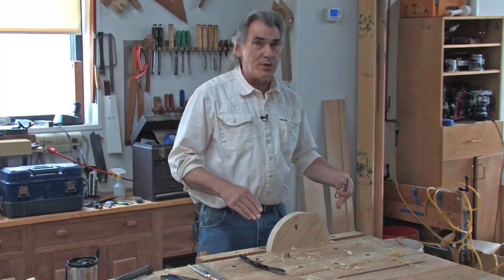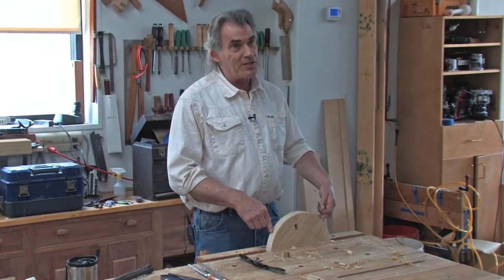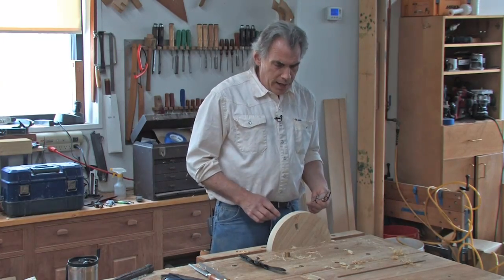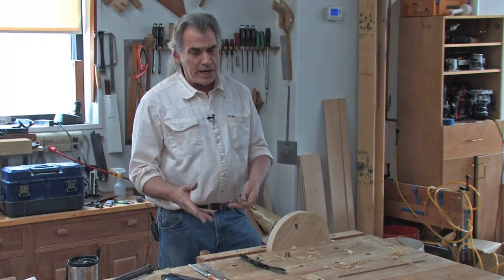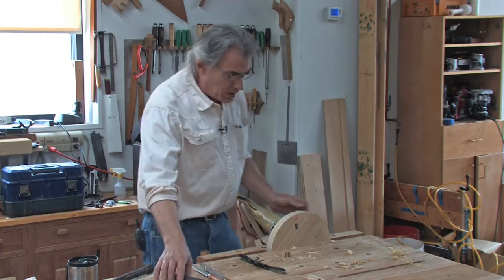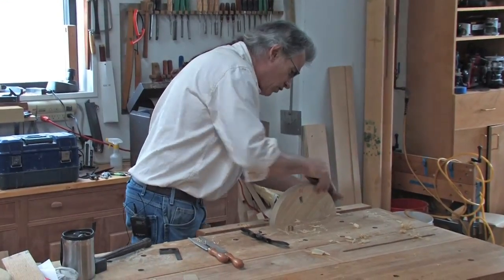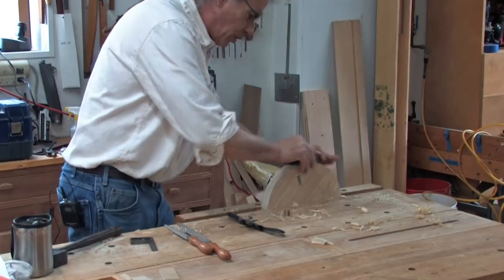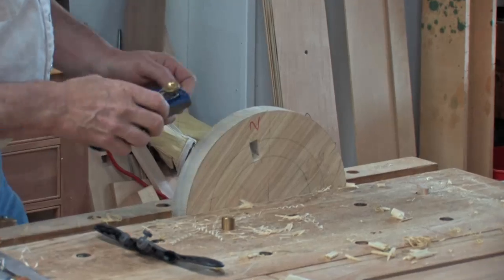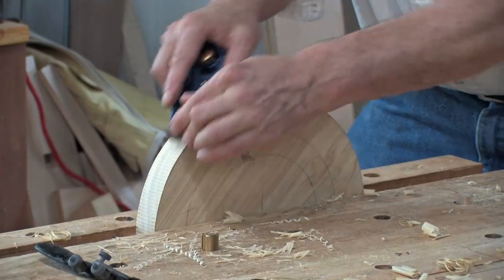And this is also a way to get good at cutting them on the bandsaw, is to do this kind of work a few times. So you won't know how good a job you did sawing till you get over here. And so really I can cut it, or I can use a more abrasive method. And cutting it, I can use a block plane and just roll it around the edge. And I do need to pay attention to the grain direction a little bit. I want to be going downhill on the curve and also be watching where the grain is. So I may have to shift around, go the other way.